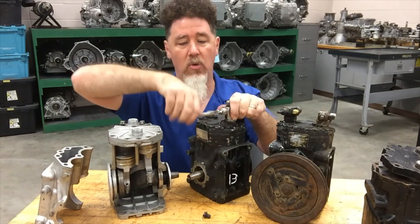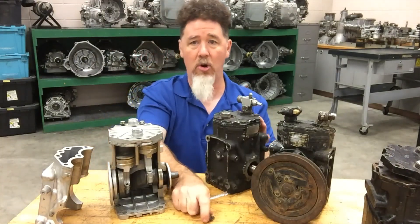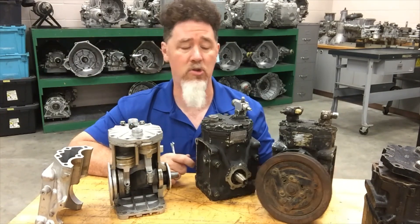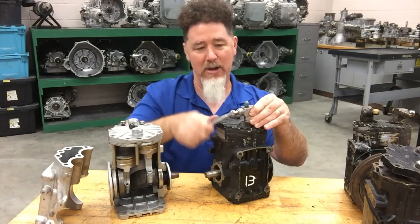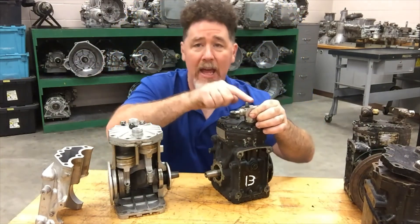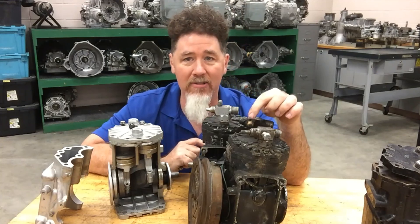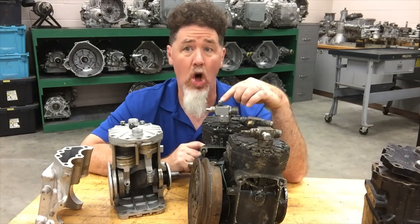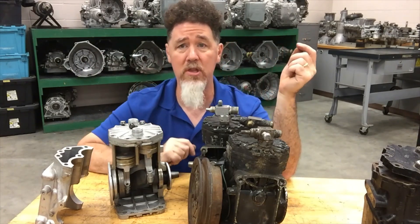If I'm going to go to the original back seated position and pull out the oil plug to check oil in the compressor — which you need to do on occasion, or the compressor can burn up, because if you keep oil in these things they're going to last forever — you have to go through the mid seat position. It takes a few turns to get to the back seated position. In the meantime, if you don't have a set of gauges hooked up, there is no valve in there and all the refrigerant is leaking out. So what's nice is it has caps on it — if you have your caps on, you don't have to worry so much. But if you have one without caps, you're going to want to put your gauges on it so you're not losing refrigerant going from the front seated to the back seated position.